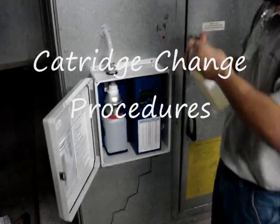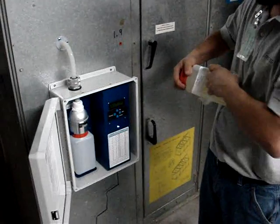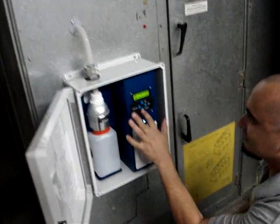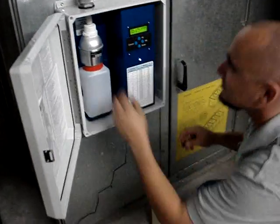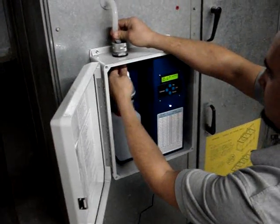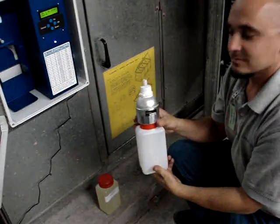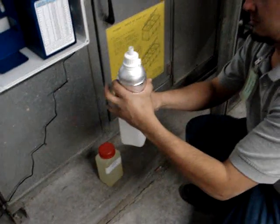To change out a cartridge, first unpack the new cartridge of fragrance. Aqua Fresca. Next, ensure the device is turned off. Now what you want to do is disconnect the bottle from the stem by removing the hose and pulling forward on the bottle. Fully removing it and keeping it free from spilling. Next you want to unscrew the nebulizing head from the empty cartridge.